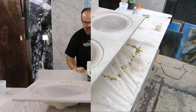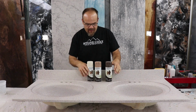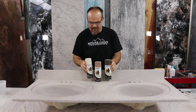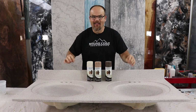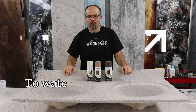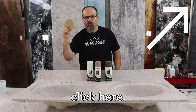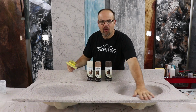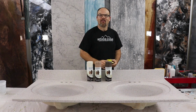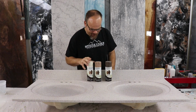Yeah. Okay guys, the fun part's about to start. What we did last night is we sprayed this with the stone accents. We got it really prepped for that clear coat. It didn't dry fast enough to do the clear on our live video, but here we are the next day. We're going to apply the clear, but first thing we're going to do is sand with 220 grit to knock off any real high points, and then we're ready for the clear coat. And that makes this thing pop and come to life. Let's get started right now.